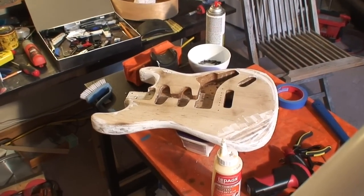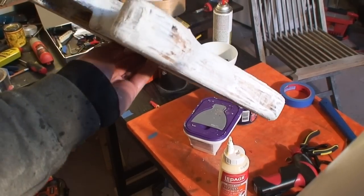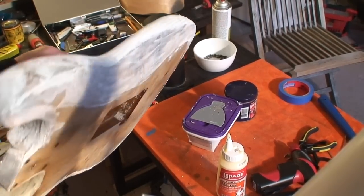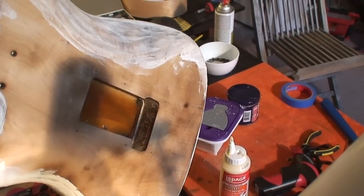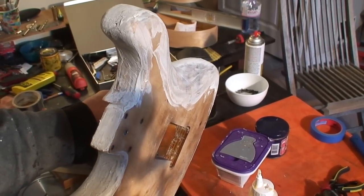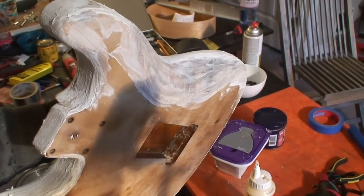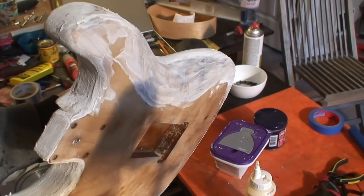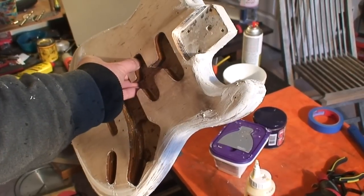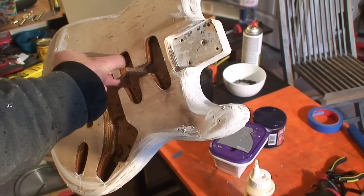I just spent the last little while grain filling all around the outer edges and everywhere where you can see it's plywood. It looks a bit rough at the moment but I'm going to sand all that down — I only want the filler in the little cracks. With this one I'm trying to avoid wasting paint and material to fill all these little holes, so I'm going to grain fill it. I'm absolutely using wall putty — it's no big deal. Wall putty is fine for this because it's just going to stay right in the little grain pockets. It's essentially the same material as wood filler, as far as I'm concerned. I've used it tons of times on stuff I've painted. So don't get your knickers in a twist.